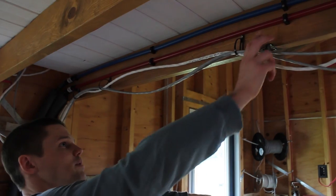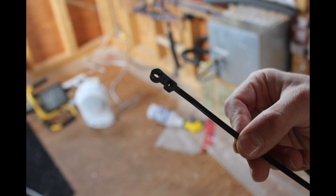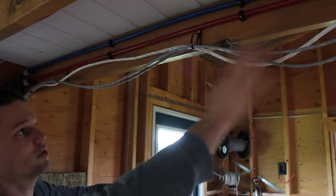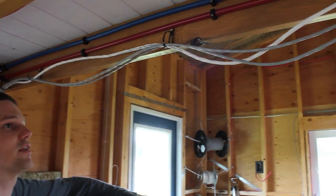Because we're going to have quite a big bundle of cables here, instead of stapling them all down, I'm using these zip ties that have a hole for a screw in them. I've got the loop just started so that I can keep adding cables in, and then once I'm confident I've got absolutely everything, I can cinch them down and straighten out the cables nicely.